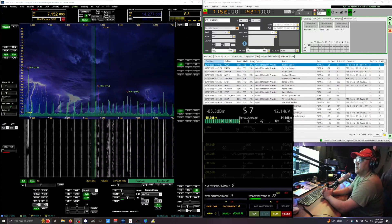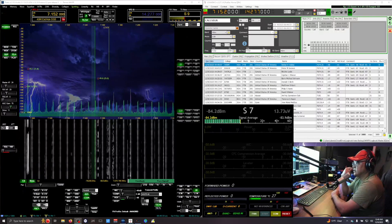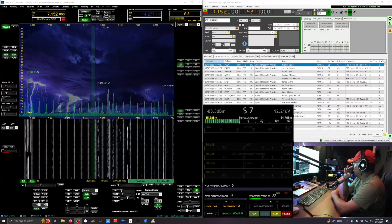I think I fixed it — I did not hear any RFI coming through my headset. You saw it: I increased the power and I think I was pushing about one kilowatt. So you get a toroid, particularly the ones that are in the HF band — FT240-31 is the one I'm using. I took two cores, two toroids, put them together, put electrical tape around them, and then wrapped the XLR cable as much as you can. I'm satisfied — I resolved it. If you like my content, please consider clicking that subscribe button, leave me a like and a comment.